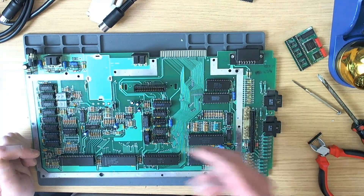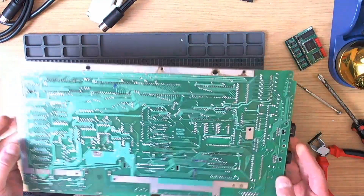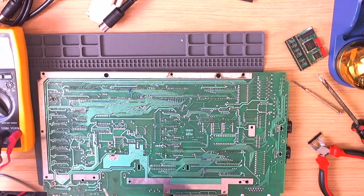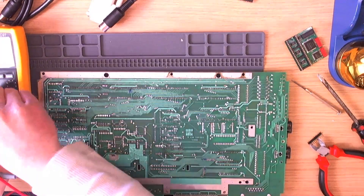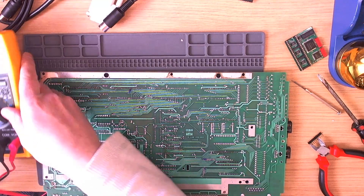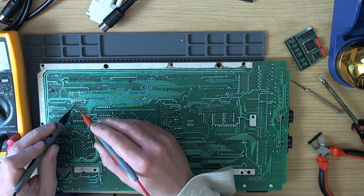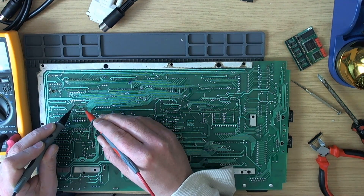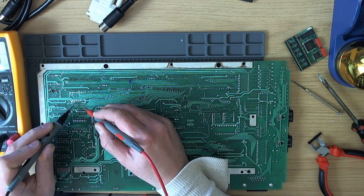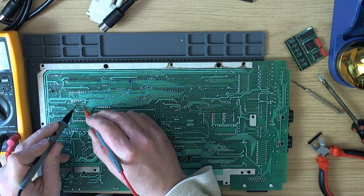There were no problems with the RAM on the board, but when I took this chip out again, the thing wouldn't boot. So I took the chip off and put the meter in diode mode to investigate. What I usually do is work along the back of the chip, scrape away a little bit of solder mask, and check for continuity.